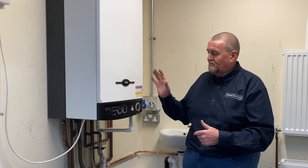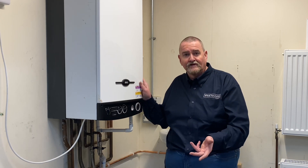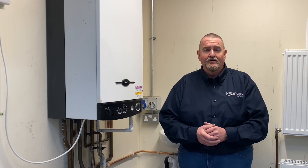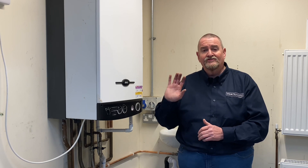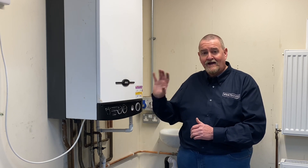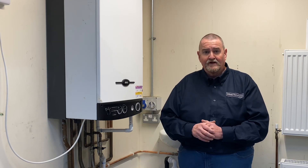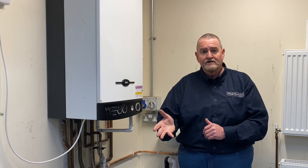The first thing we're going to do is look at the expansion vessel on this Instant version and replace it. The expansion vessel on the Instant was not just used as an expansion vessel, it was also used as a thermal store. In winter when water comes into the property a bit colder, you have that lag with most combis getting it to the tap. The idea of the Instant was you've got 7 litres of water kept at boiler temperature so as soon as the hot tap is opened it drops straight into the plate heat exchanger, which didn't take as long to heat up.